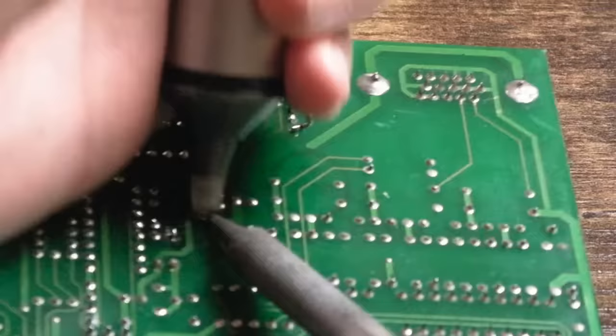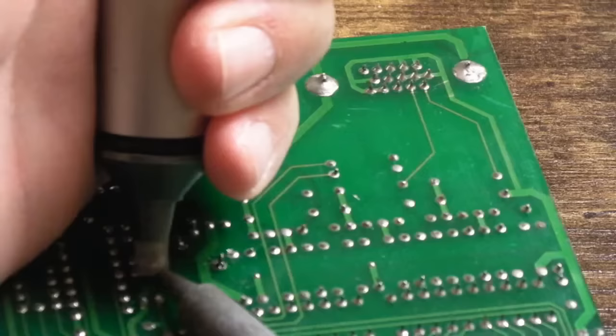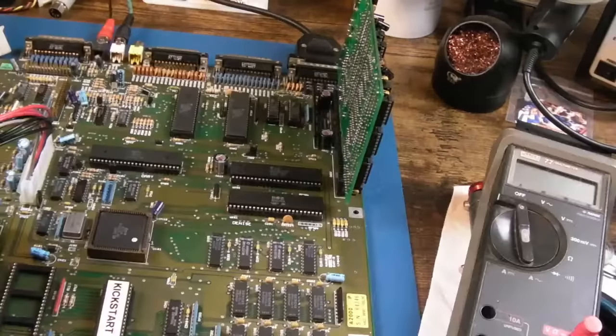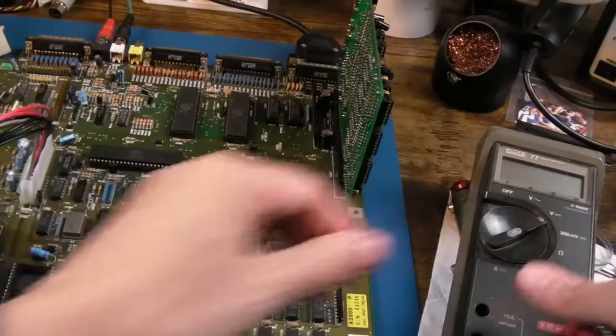There's a marking that says something like '2/6 2' — I don't know if that means 2 picofarad or what. I've got some replacement trim caps here — two to ten picofarad. Let's swap it out and see if there's any life back in this. I'm kind of expecting this to make zero difference though. This is where the video started — it came to me doing nothing, I inspected and re-socketed things, it started to work but only with the tick signal set correctly. Has it been the trim cap all along?